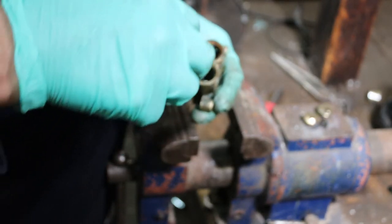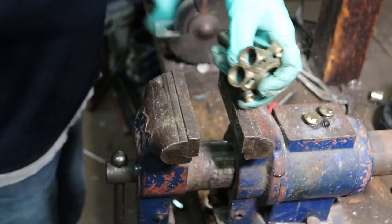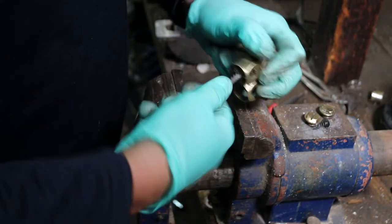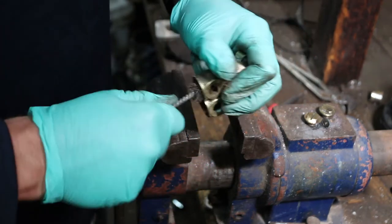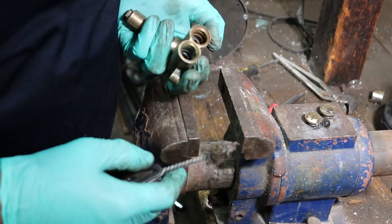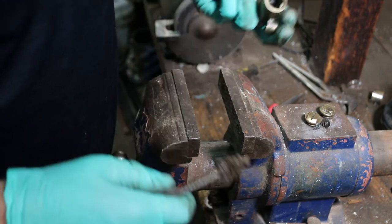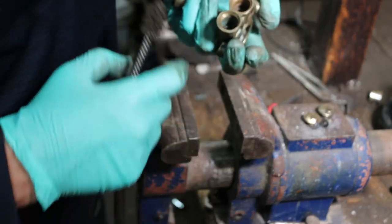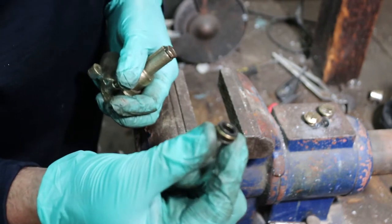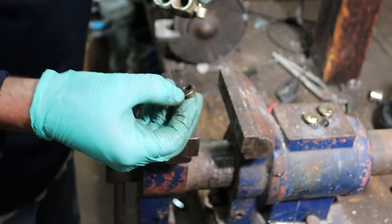Wow, this is probably one of the worst ones I've seen. I'm going to have to take a wire brush for this. Be sure to wear safety goggles when you do this stuff — a lot of bits and pieces tend to fly. That came out real well. Next, we're going to get this cleaned up, clean these nuts up, and then take the seats out of this thing. I'll show you how to do that. This is a seat — this is what we're trying to remove, and here's what a new seat looks like. It threads down into this hole in the body.